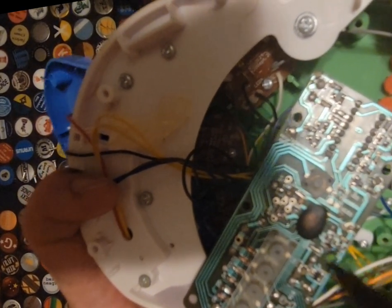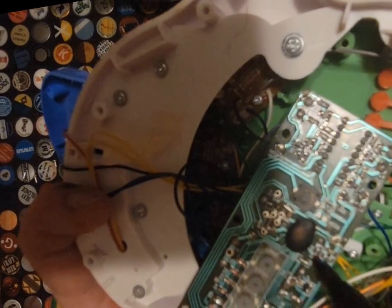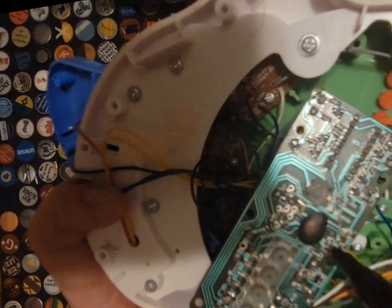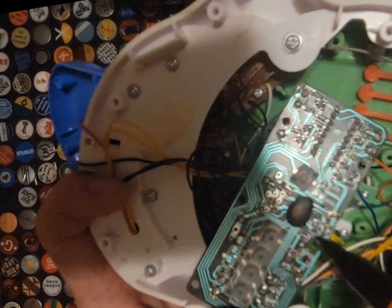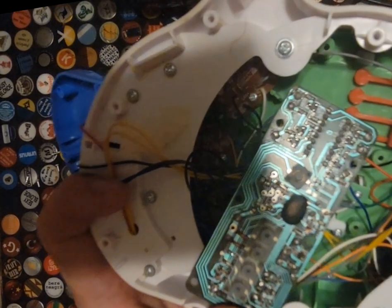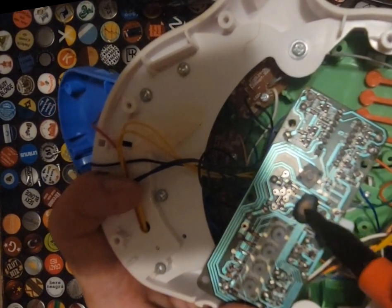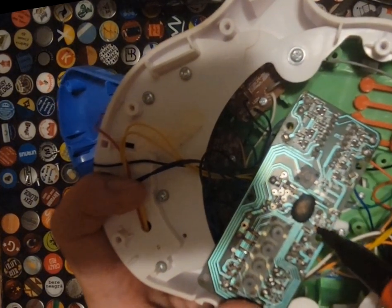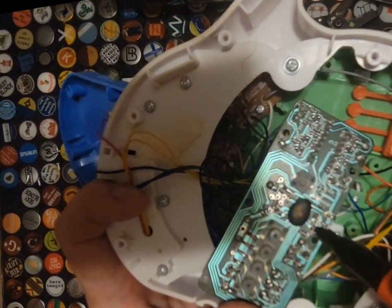Because a lot of times with these micro resistors, what's going to happen is if you solder onto this, as we know, the resistor pulls up. So we only want to touch one side. Realistically, we don't want to touch any side of this, but we do have to touch one side because we have the smudge point. At that point, we don't know where everything goes. One of these is going to be our median.